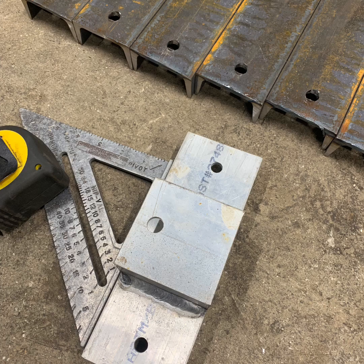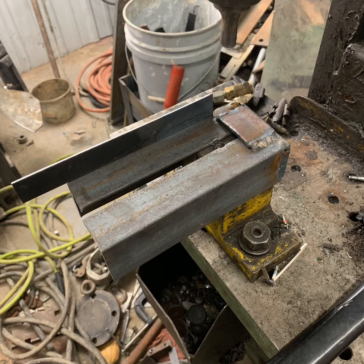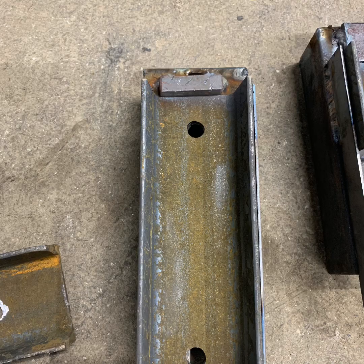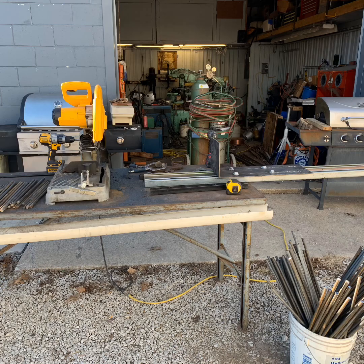These are some pieces I had to make for a company, and I had to make some jigs for the Piranha. This is one jig I made so it would center the hole in the right spot. I had to make a jig for each piece because there were two different kinds of holes. And to cut all the bar and angle, I made an adjustable backstop out of some unistrut and that plate.